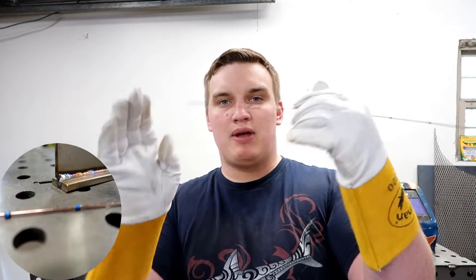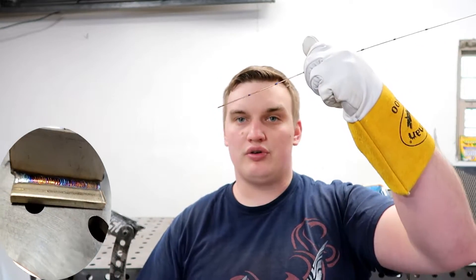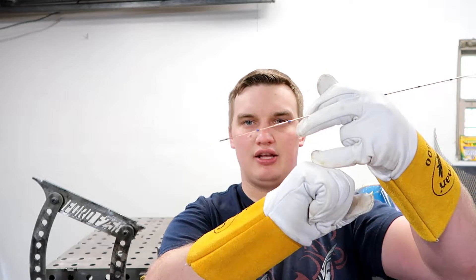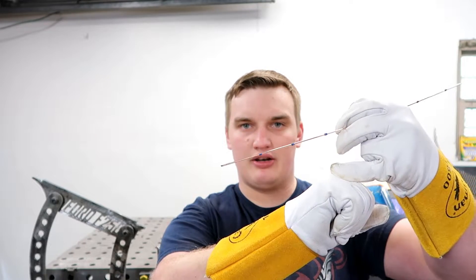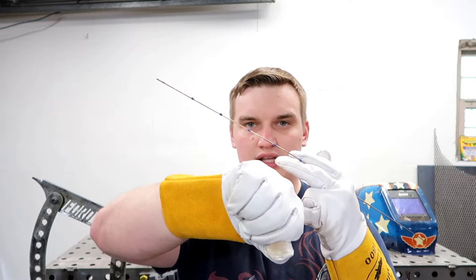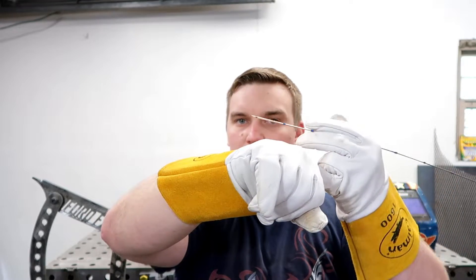There are so many benefits to this method. First and foremost, you're not burning your glove. Also by utilizing this method you can utilize rests — with the fixed method the only place you can really rest is your elbow, and by that time you have so much motion you cannot hold a steady hand. Whereas with this method I like to utilize my pinky; you can rest it on your work, and you can work the rod smoothly, or if you're going around a tube you can put that pinky on the tube and pivot off it to work all the way around.